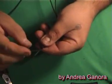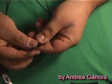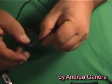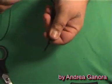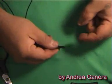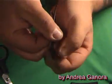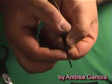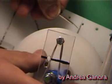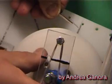Now practically the switch is ready. A little bit of adjustment of the blades, and I will show you how it can work either magnetically and mechanically. At this point we can fix a piece of wire or something more stiff on the back of one of the blades so it doesn't bend. In this way you can see it is only one of the blades that activates the switch.